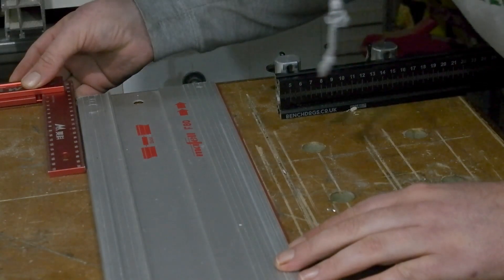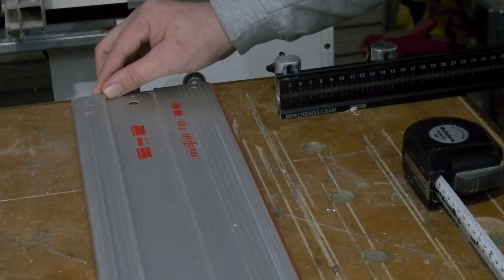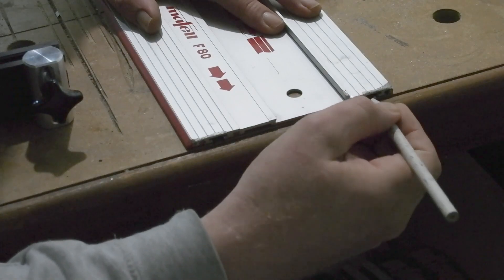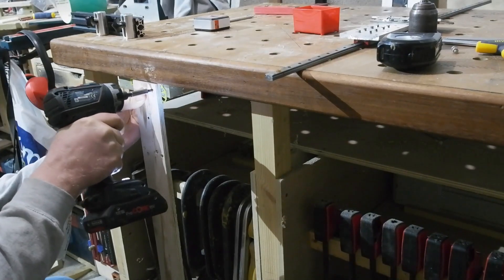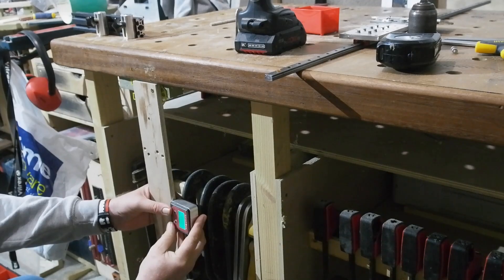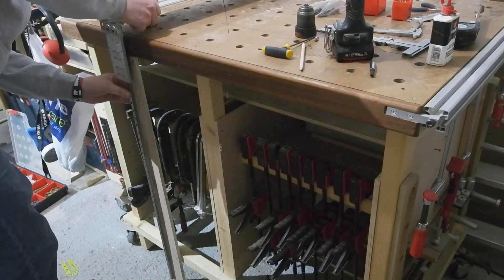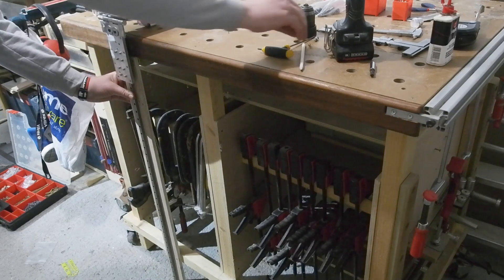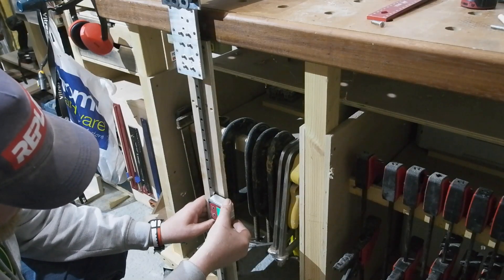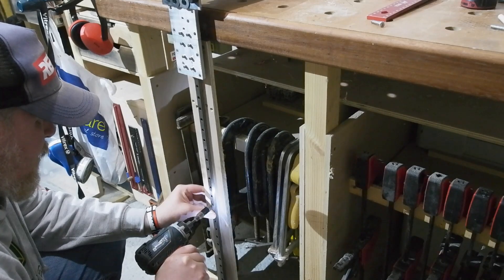The Bench Dogs right side or wayside fences have a scale whose first number marking is at 50mm, with the end of the fence rail side being essentially a 40mm marker. I'm going to aim for a good 50-60mm clearance as I mark the new rail position with a pencil. Rail slots marked, I centre the ply to them and put in one screw. Then I use a digital level box zeroed to the bench top to set it at 90 degrees, then fix with more screws. Same deal setting the linear rail — with the attached guide rail resting on the level box, which conveniently is the same as my max cut height, to position the first screw. Then again I employ the level box to set the linear rail 90 degrees to the bench top. It's important that in relation to the bench top the rails are straight up and down — if they were askew you might be dead square cutting 12mm ply, but lifting the guide rail to cut something 50mm thick you'd be off, and that's no good.